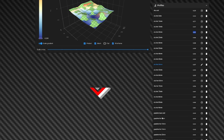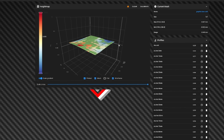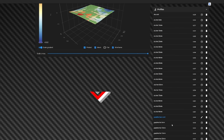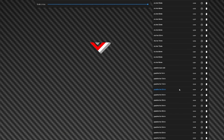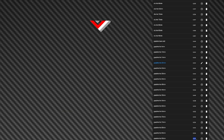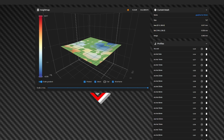Compare that to the graphite bed plate. The cold reading was 0.05 mm — pretty well machined and ultra flat. But the most important thing is the result over time: after 20 minutes with the hot bed, we're still at 0.044 mm, and all the way up to 90 minutes it was still not moving — still super ultra flat. Not a lot of movement at all. I was super impressed, and I'm still super happy with that heat bed.